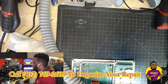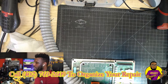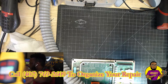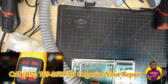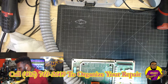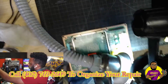All right, we have it all the way down to the motherboard. The first thing we're going to do is take our tweezers — our Husky tweezers — and our Wagner heat gun. I'm going to show you exactly where I put the settings: I put the fan on high, and the heat on the second highest bar. It's at the second hottest setting it can get.